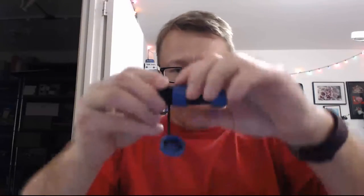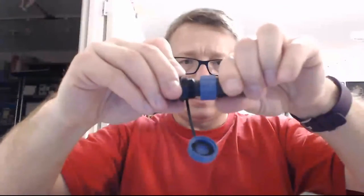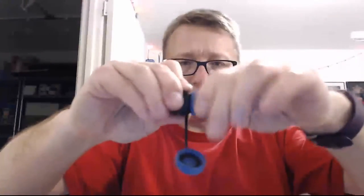I'll show it to you — this is actually the connector. It's completely and utterly weatherproof. It screws open and pulls apart just like this. They come in multiple pin sizes; in this case I got three pins. The string that I have is three pins, and the power is also three pins, so this is perfect for my application. If you have a clocked version of the RGB LEDs and need four pins, three pins will still work for your power. You can see the nut here — this screws to the side of the wall, then you plug this in. It's keyed so you always attach it correctly, then it spins in and it's super tight. There's also a waterproof gasket on this side; the wires come in from this side, and then you screw this down and it tightens.